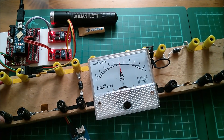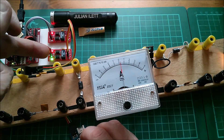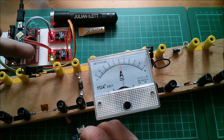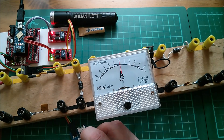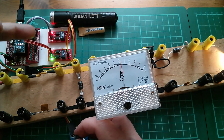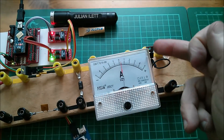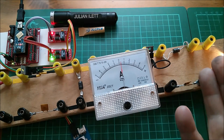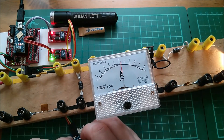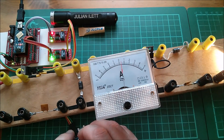I've got 12 volts coming in from my solar power system - actually 13 and a half - and this is now working. I can turn on the lamp when the first MOSFET driver, the buck MOSFET driver, starts conducting and I've got a bit of current on my ammeter. Now what I want to do is implement the boost, which is further up the travel of this pot. This only goes to 50% because you don't want to turn this MOSFET - which is running directly between your voltage rail and ground - permanently on, otherwise you'd create a short.